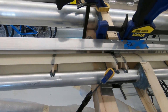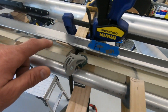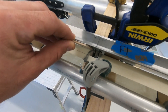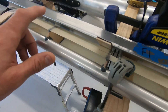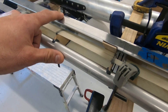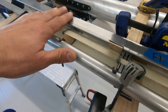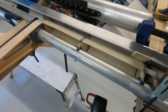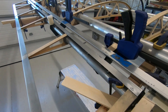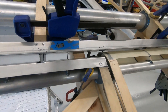They wanted an eighth-inch gap between the flap leading edge and the wing trailing edge — here are my eighth-inch spacers. There's also an option to do a flap gap seal between the top of the trailing edge of the wing and the flap to kind of close that off. I think I'll probably make an aileron gap seal also. The gap on the aileron is a little bit bigger than what the flap is because of the leading edge differences.